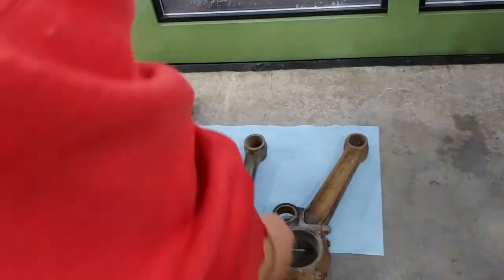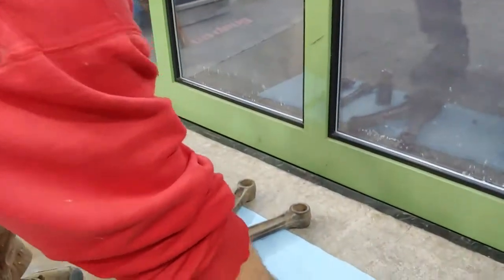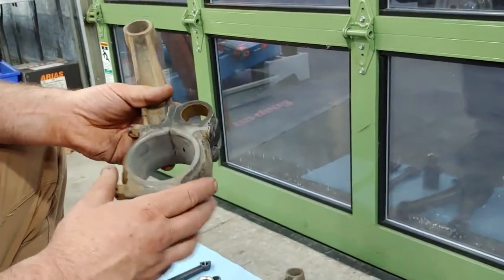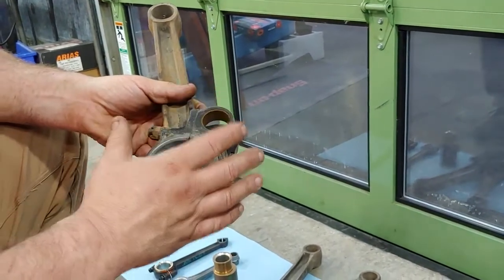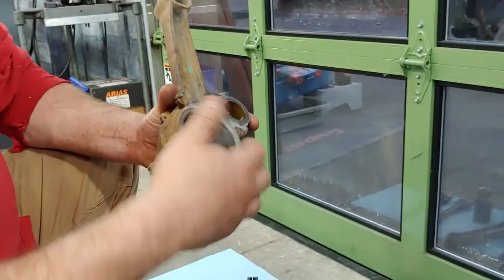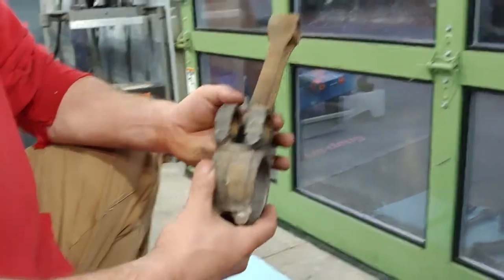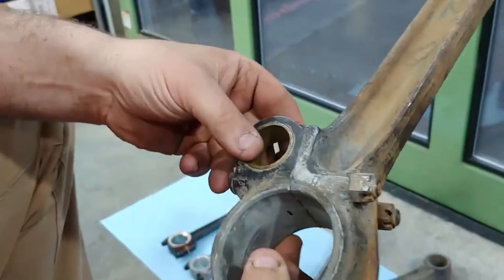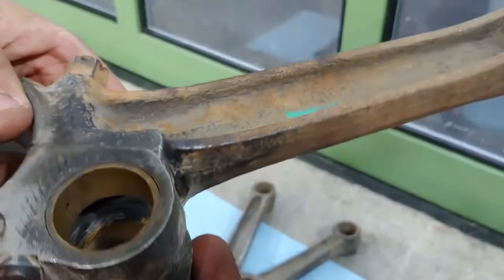Also arriving from Hankel were the Master and Link connecting rods. Three of the connecting rods were Babbitt rods and three of them were inserts, so it doesn't matter — it's the same rod, we can use it. Later in the company's history they switched to inserts. Kevin actually found the Federal Mogul number on the insert rods. These are Babbitt rods right here. We took this one apart just to show everybody how it works. The Park Ohio guys and the Cleveland Crankshaft — you guys built this rod too, so there's a lot of Ohio history in this.